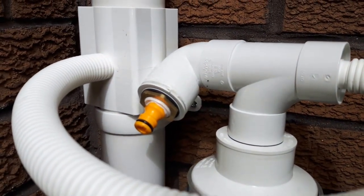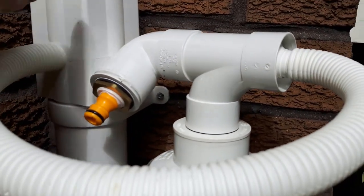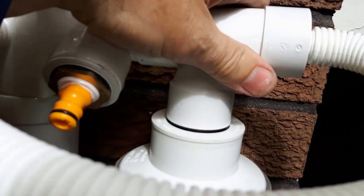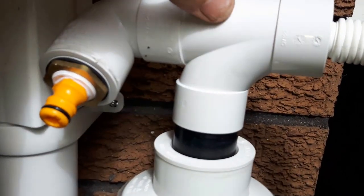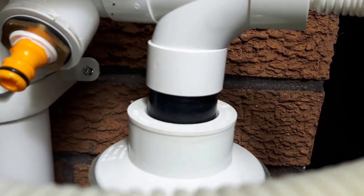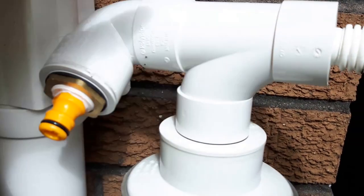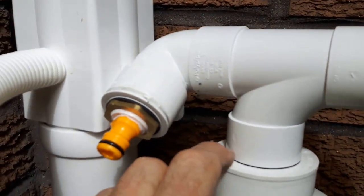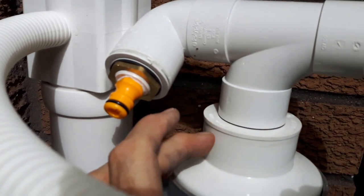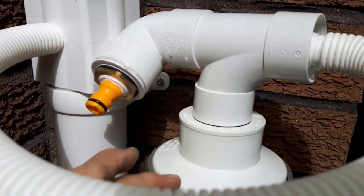I'm going to use proper pipe eventually but I've just got to make do with hose pipe now just to save expenses. Going from this T-piece here I've got a little bit of a short piece of solvent weld 40 millimeter which again I haven't solvent welded - it's a really tight fit, so I won't glue that unless it leaks. I'd like to be able to get in there to inspect it. I've got a 40 to 68 reducer here on the top, and then this goes into a 110 to 68 reducer.